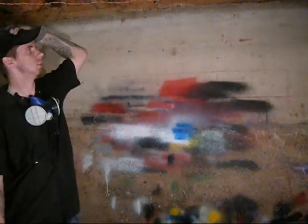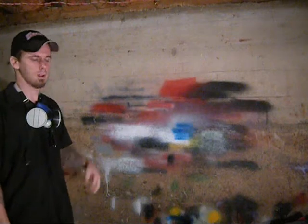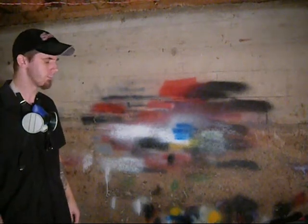The only thing I don't like is you've got your rafters in here. If you're going to be doing any painting, you should put a sheet of chipboard or Mylar or something upstairs so that the dirt and stuff doesn't fall down in. But I don't really keep my wet stuff in here. I just do a quick spray, then it goes back over to the shop and I let it gas off over there because I have ventilation in there.